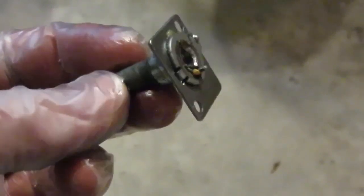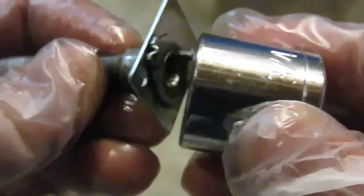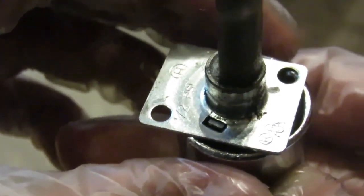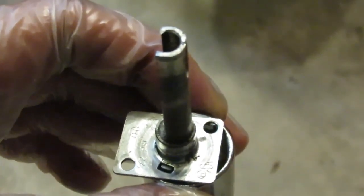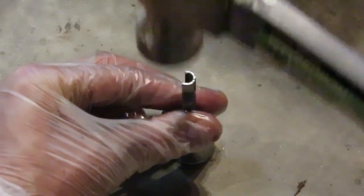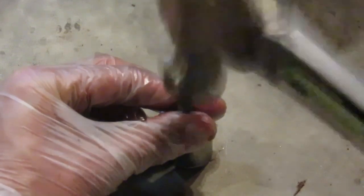For this valve, I need to press this shaft through this plate. This is a three-quarter-inch socket I found in my toolbox that just happens to fit perfectly right over here — the moving plate goes right inside it and the rectangular plate rests on top. So I can apply some elbow grease, put a hammer to it, and gently tap the shaft down. I've done this with the first valve and it worked — you just have to be very gentle and patient. There it goes — you could probably hear it — it moves very slightly, and there it goes.